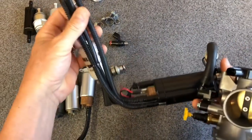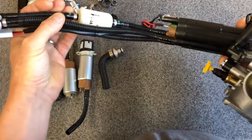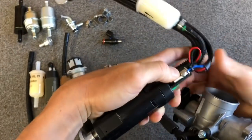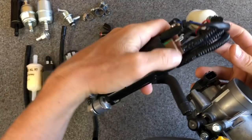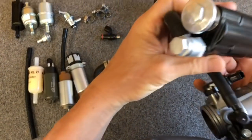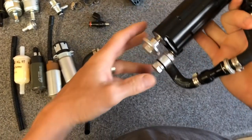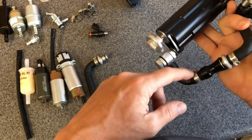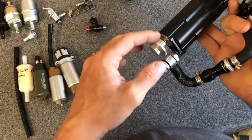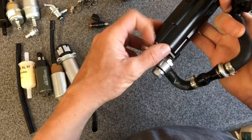These are hoses — one is the pressure line to the bike, one is pressure from the pump, and one is the return. This is the fuel low light indicator on your dash. Here's the pump motor itself and its outlet port. This is where the pump motor lives. Outlet ports on the bottom of the pump go to the injector and throttle body. This here is the pressurized, regulated pressure quick-disconnect coupling. This is just an anchor bolt adapter for the tank holding all of this inside.